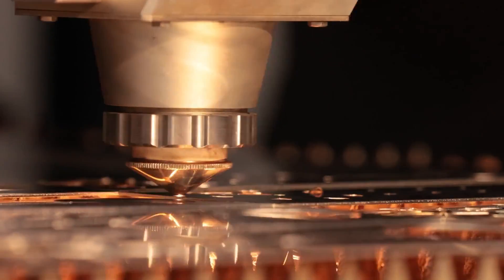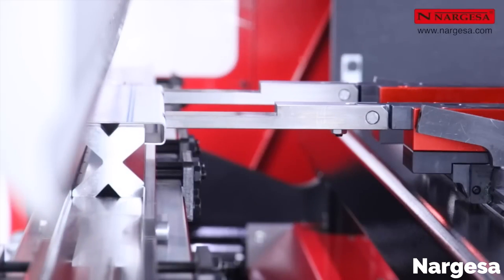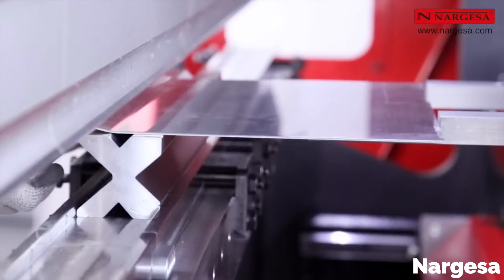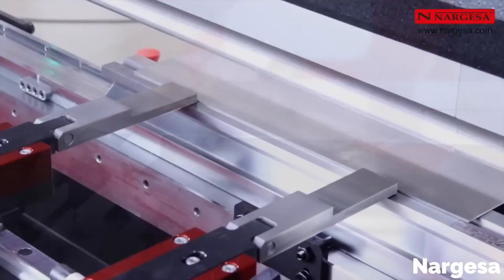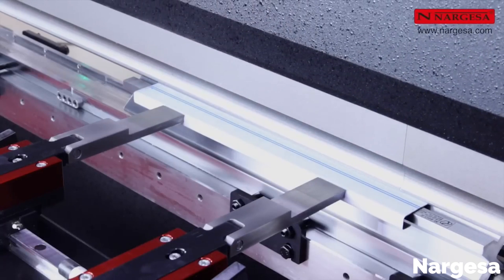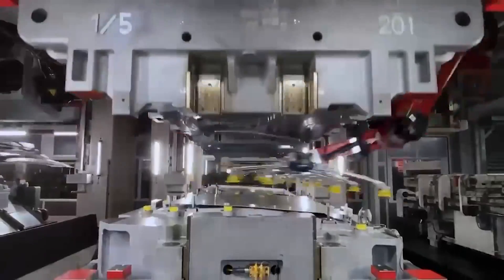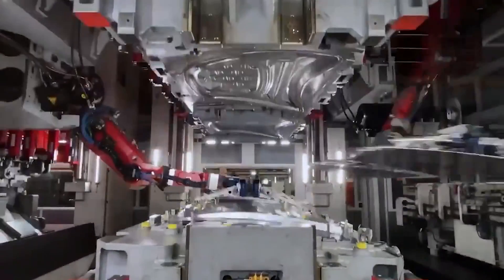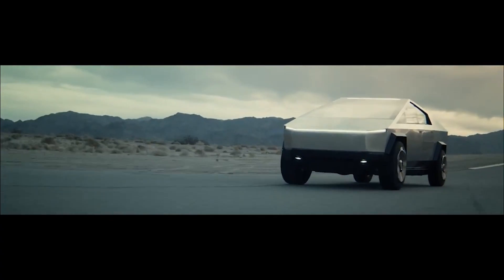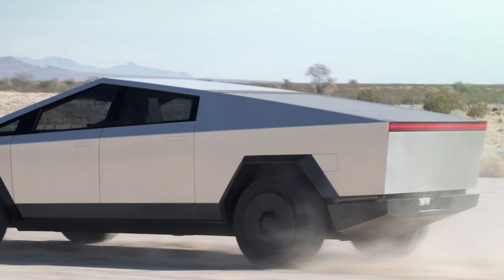The only way to form this grade of steel into a shape is to fold it. What they do is first score the metal using a laser, and then they put it into a machine called a press brake. This has a long, narrow die channel that sets the angle that the metal will bend at. Then there is a punch tool that hammers down on the sheet of metal with a narrow edge that concentrates all of the energy exactly where they want the steel to bend and presses it into the desired angle. The manufacturing advantage to this process is also huge. Compared to traditional stamping, the Cybertruck doesn't need a bunch of custom dies and stamping machines, just the press brake with the desired angle. That's why the Cybertruck has no curves — because it would be physically impossible given the material choice they made.